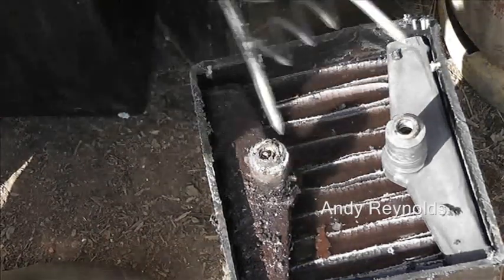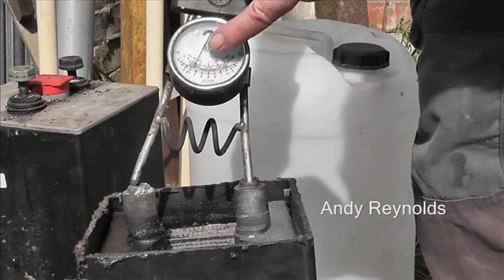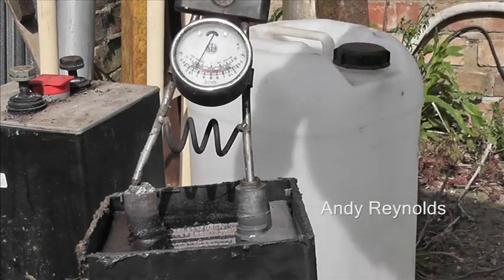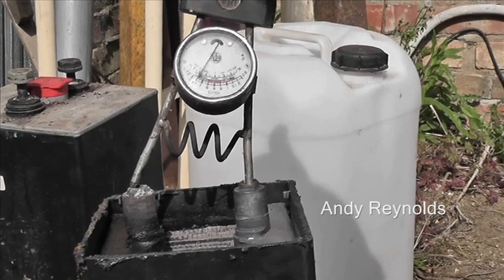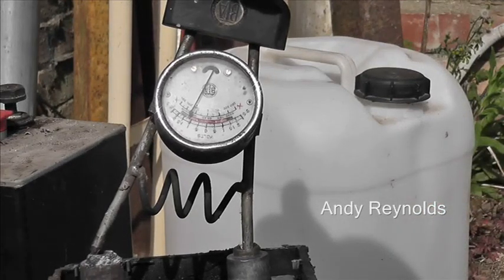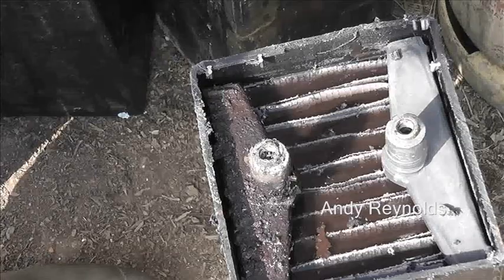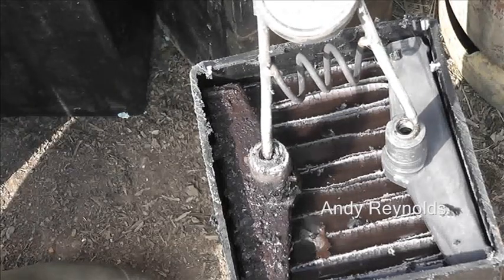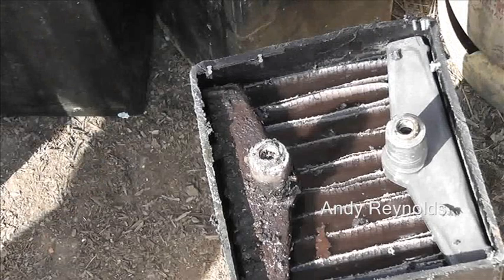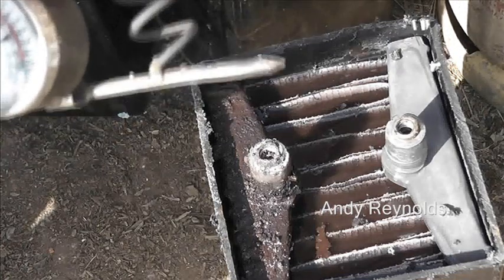I've got the old drop tester here — it's just at the bottom of the 1.5. Hopefully you can see that. So it's not brilliant and it's going down a bit, which tells you quite a lot. It has been sat for a while, but this pack was creating a nuisance. That's a bit of interest — and that's mighty warm now, obviously. The problem with series-parallel connections.